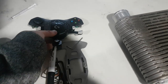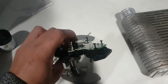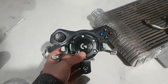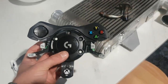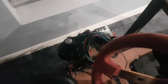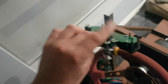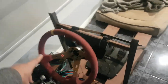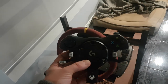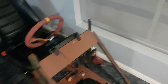As for the sim rig, I've taken the buttons out. This is the section that used to go behind the steering wheel — it's got the circuit board and the little switches for the paddles. I need to pull one of these off and make it into a handbrake. I couldn't get the steering wheel to mount upside down and swap this around, so I'm going to end up remote mounting it, which is also good because it's not behind the steering wheel. I've added the power box for the seats, and I'm going to put a cup holder on and try and mount the button panel so you can get to it easily — one of these switches is going to become the handbrake. I've mounted the base upside down and put the steering wheel back on upside down so it's now up the correct way. All I need to do now is rewire this, make the wire a bit longer, mount that somewhere, and then cut, weld, and paint everything else. Then it'll be done.